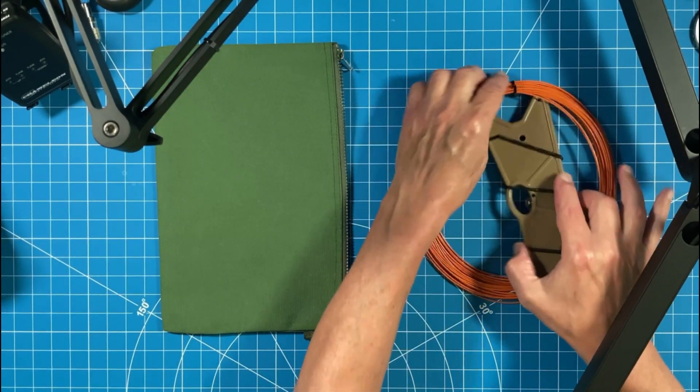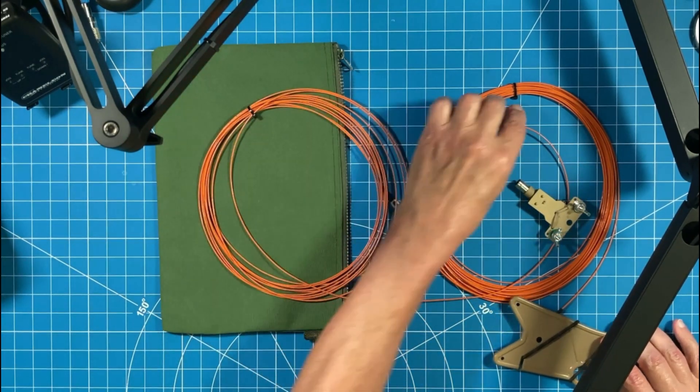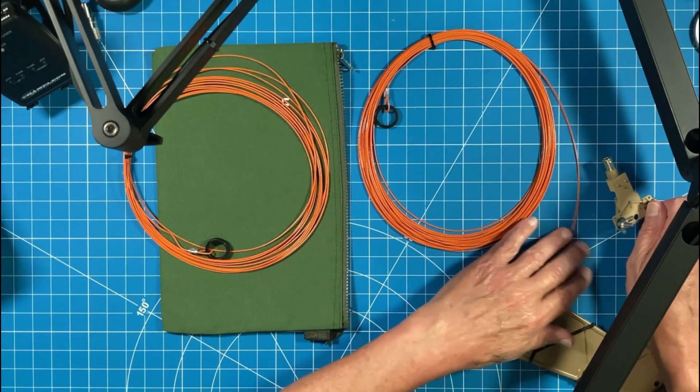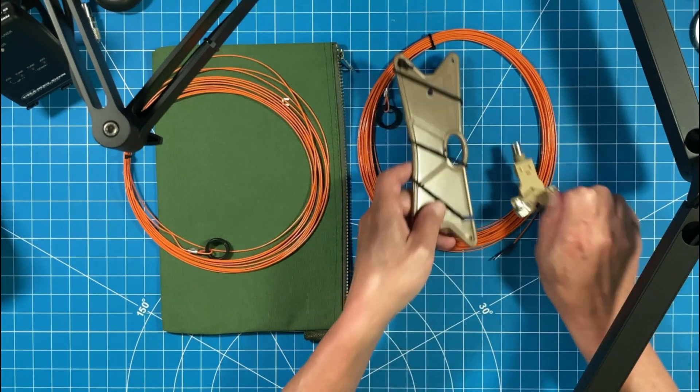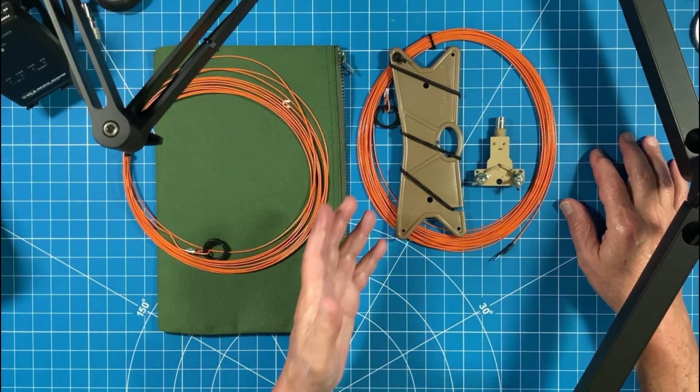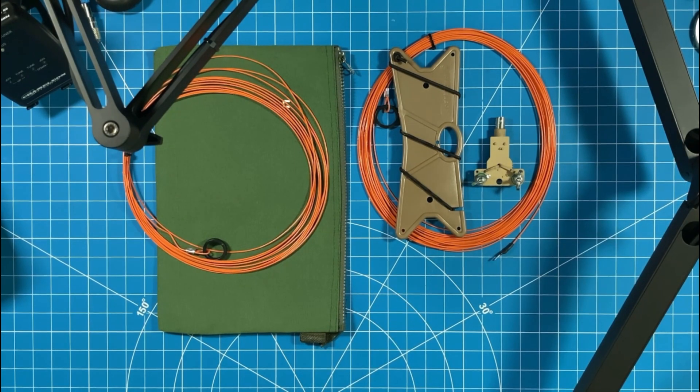This comes with two different lengths of wire, and it's going to be good on 40 and 20, which are two of my favorite operating bands, and then on 10 and 6 meters. We're going to take this backyard portable, get it set up, and do a demonstration. I'm Bob, KD4BMG, HOA Ham. I call this stealth because you could use it at your HOA — with the appropriate color wire you can just blend into the sky. I chose high-vis orange so you can see what I'm doing, but you can pick several different colors.